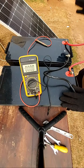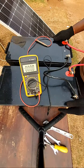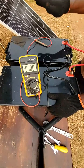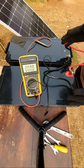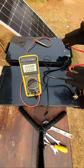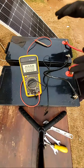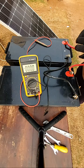There are a few things you need to consider before connecting your batteries either in series or in parallel. Number one is that your batteries should be identical. If this is 12 volts, 200 amps, this battery also should be 12 volts, 200 amps. Don't mix mismatched batteries when connecting them in series or in parallel. Always connect identical batteries in a battery bank. Don't use different batteries with different ratings or capacities in the same battery bank — it will not operate efficiently.